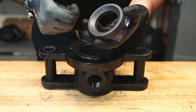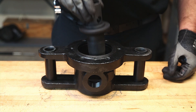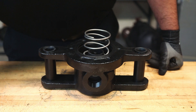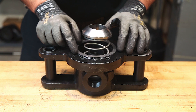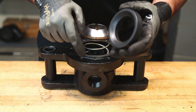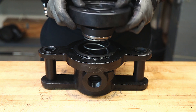Gently place a new seal ring with the concave side facing upward, followed by the nipple. Then place the spring and the thrust collar onto the nipple. Be sure that the keyways are aligned with the keys on the nipple. Place a new gasket on the body opening. Lastly, place the second seal ring on the thrust collar with the concave side down, followed by the retention plate.